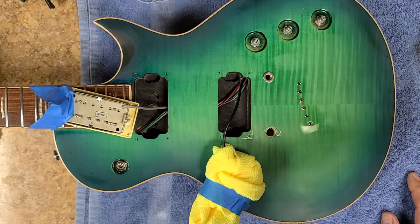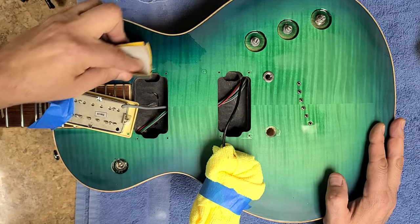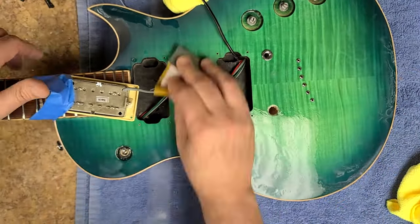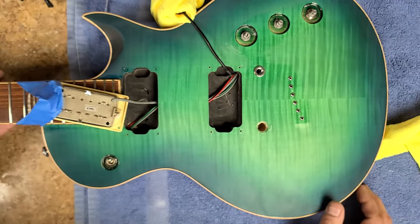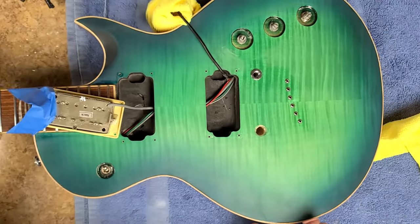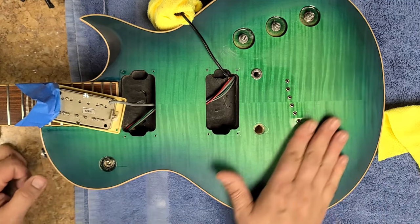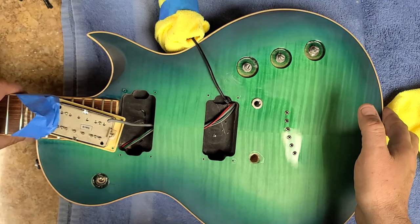This looks kind of nice with a flat finish — it has almost a three-dimensional effect to it. But once I get this sanded down and buffed out it's going to have its own nice effect. Looking at it now I don't see any low spots or shiny spots, and it looks like the 2000 took care of the scratches from the 1500. It's nice and really really smooth. I'm ready to go ahead and start buffing out the top to get that shine back.